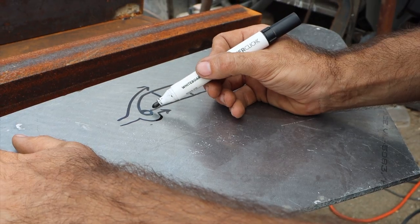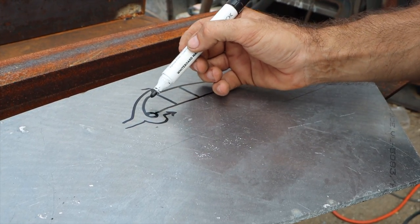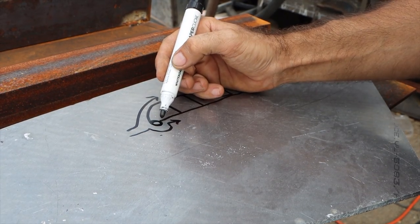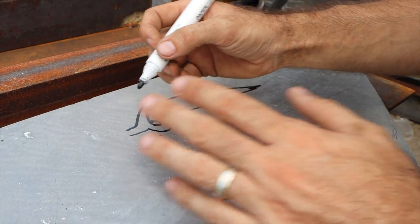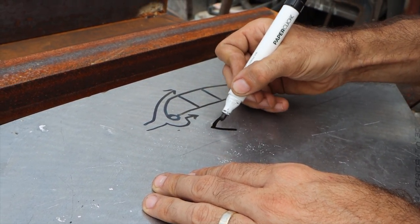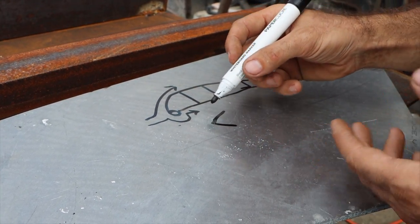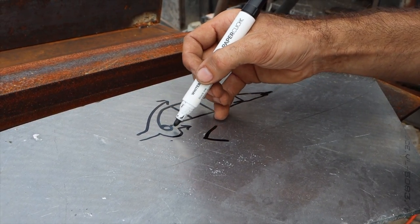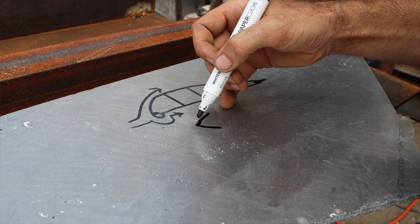So what we needed to do was come up with a better solution for the front. My original idea was to basically get the bottom skin and just weld it onto the top skin. So you end up, it's not ideal, but you end up with more of a point at the front as opposed to a round. Rounds are better, they're way more aerodynamic, but if it was a choice between a point like that and a bad flow like that, I'd choose the point every other day.